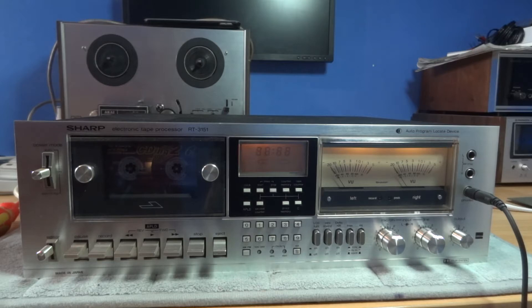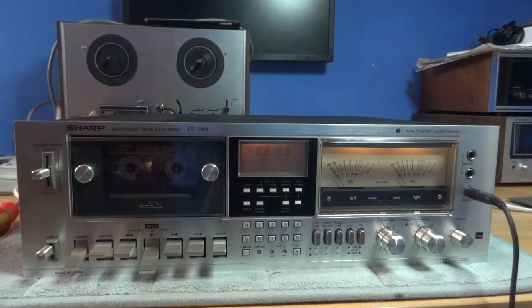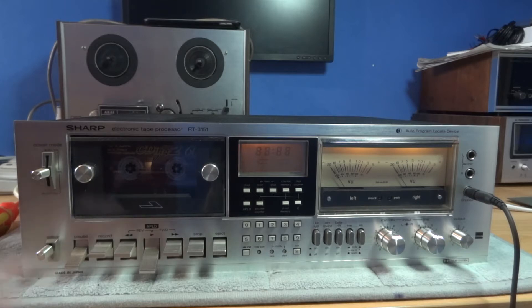I'm going to try and determine if that noise is coming from the playback side or the record side of this unit. I've played this unit back through speakers and I haven't really noticed that noise, but you're going to notice it more on in-between tracks when there's a silent part of the tape going through. We can simulate that by pressing play with the pause button down, so the play circuit is engaged. The head is connected to the little preamp inside, which is connected to the headphone socket as well as the audio out through the RCA sockets at the back. I've turned the output fully up to number 10 and you're going to hear just a very small amount of hiss — even though the tape isn't going around — this is an acceptable level.